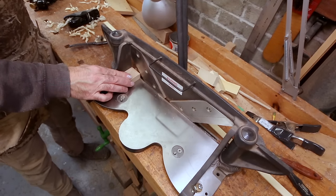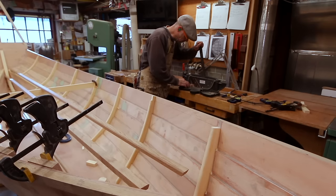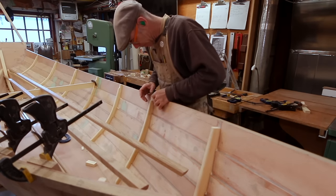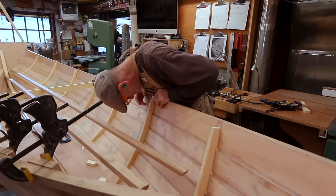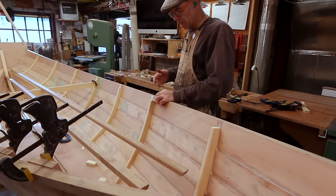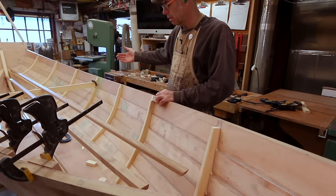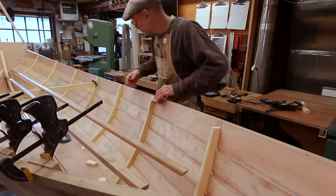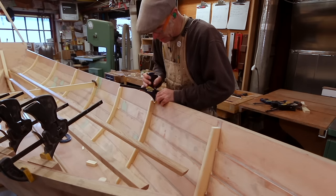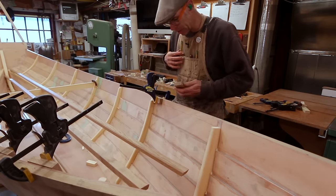When we think about a canoe, for instance, where there's frames all over the place, or any boat that's traditionally framed, of course, when you put your inwales on top of those frames, they create little spaces. And when we started building strip-built canoes and plywood dinghies, and we didn't need to have this framing in there, all of a sudden people just started adding this blocking to recreate that look of a regular gunwale. I gotta say, there's just no good reason for it. Anyhow, yes, it creates a wider gunwale that is quite structural while not being very heavy, but that's about all it's got going for it.